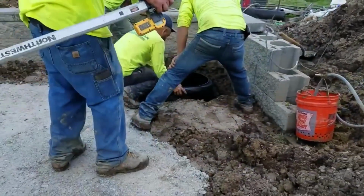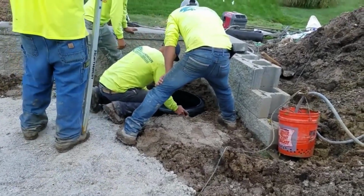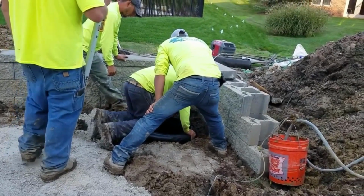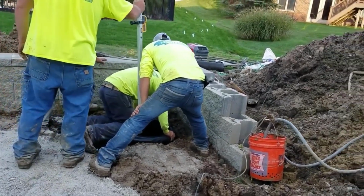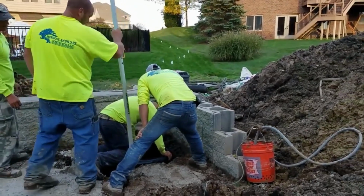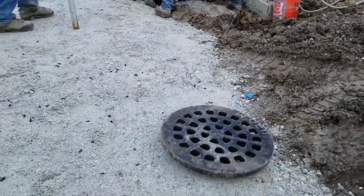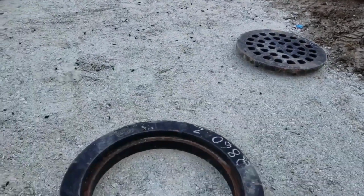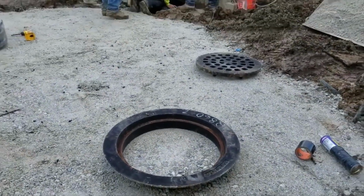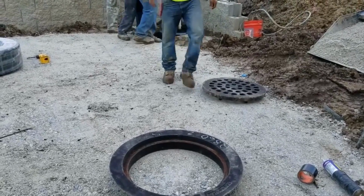We also end up doing an open French drain along the back wall, and we went ahead and did that core that you've seen us do in the past with the rubber gaskets so that none of the stone and dirt falls into that. And we put a cement floor in on that. Matter of fact, that's why that weighed so much. We actually fabbed this stuff up and then bring it to the job. And in the shop, we put a cement floor in that one.